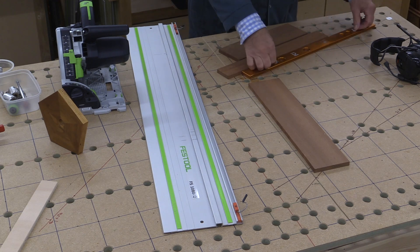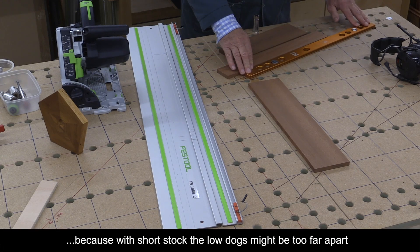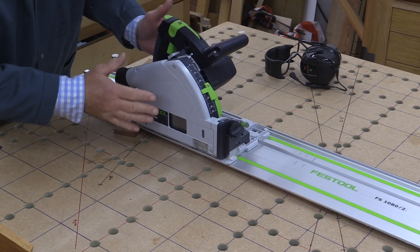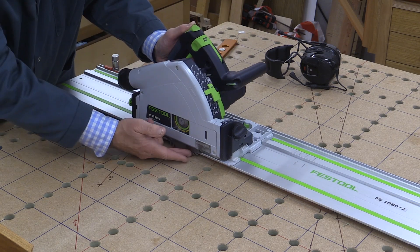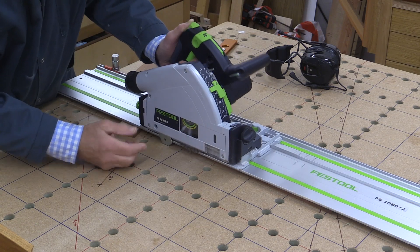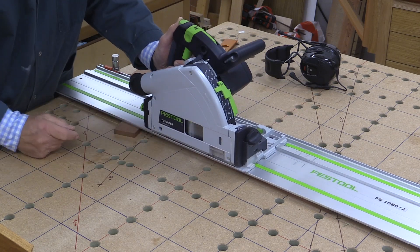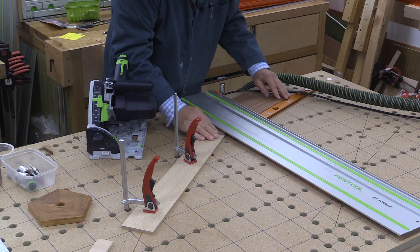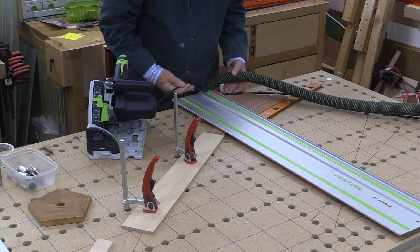The other thing — which I only did towards the end last time — was using this fence here. I think this will make a better job because it allows the stock to be supported along a greater length. What I do when I want to set the depth of cut is I put the saw, which is not connected to the power supply, onto the track and plunge it until the blade hits the bottom of the kerf line. I then raise the cutting depth all the way up and go up by one more millimeter, so that it's cutting into the kerf line but not making it any deeper. I've now fixed this piece in as my stop. Everything is all set up, so I'm going to start my series of cuts now. Fingers crossed.